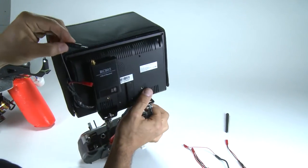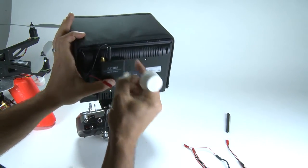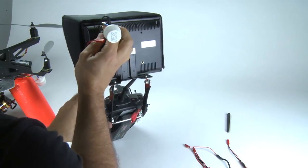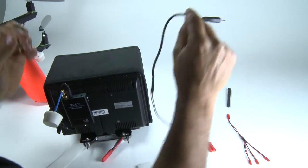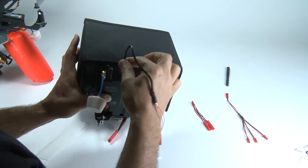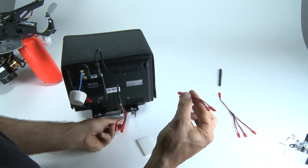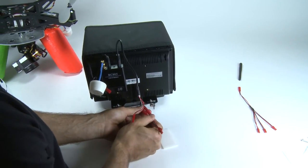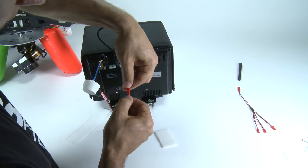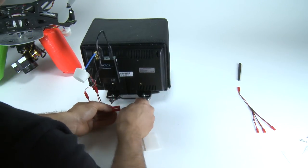We're going to take the video cable and plug it into the AV out. We're going to take the cloverleaf antenna — the receiver one — and go ahead and put it in here, nice and hand tight. For power, we have the DC 12-volt. We've already done the modifications for you — only if you bought it as an entire package from us. Plug that into your DC port. We now have two battery connectors back here, and within your package you do get the banana connector to the JSTs so you can plug your power into your battery. Plug your JSTs in, and we are completely done, other than plugging your main power in to power everything up.